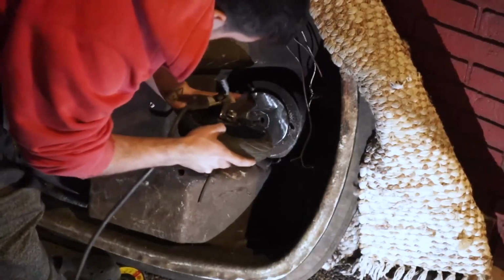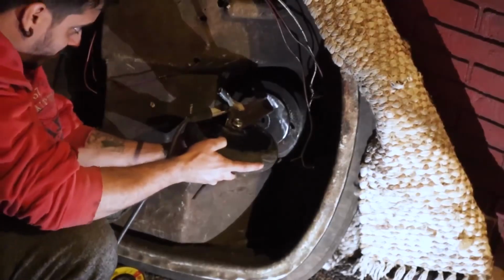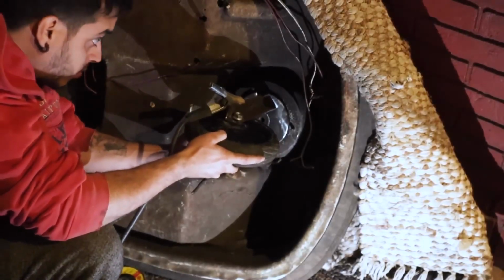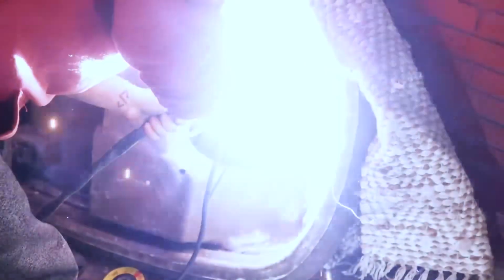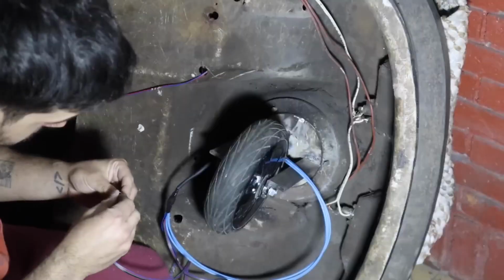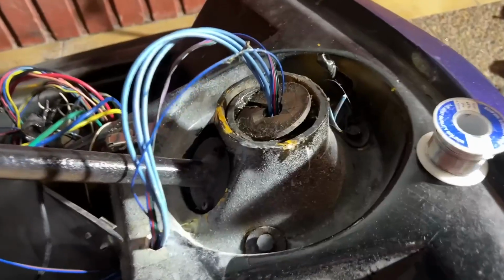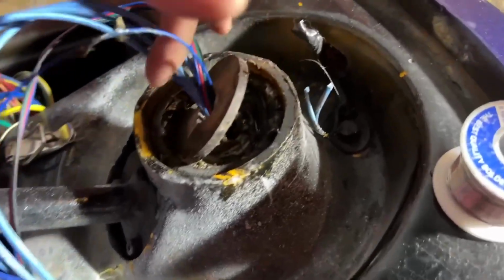This is a 360-degree rotating base that's connected directly to the steering wheel. I made 2 slots in the iron pieces to place the motor and fixed it in that spot. I enlarged the original cable hole to run the wires, as there were previously 2 wires, but now I needed 3 for the motor and 5 for the hall sensor.